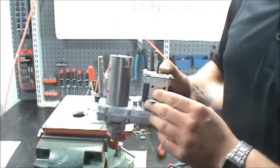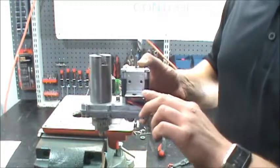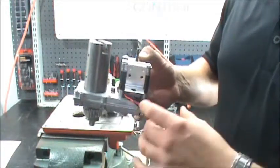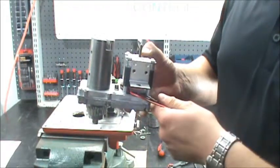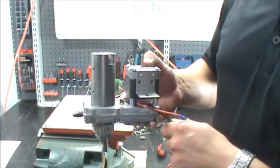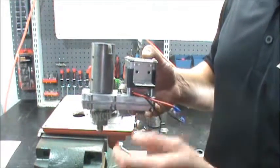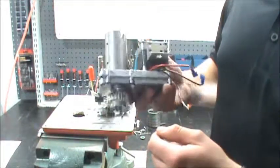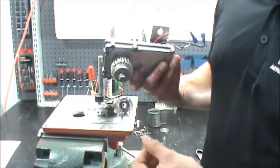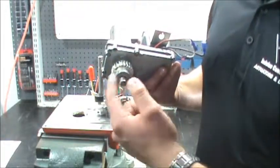Your repair kit will look about like this. It's going to come with your capacitor bracket, your brake mount bracket, the wiring and wire connectors, the output pinion, the spring mandrel, wire ties to replace the ones you've cut, and a small packet of grease. Go ahead and rip open that small packet and spread the grease around the bottom area.